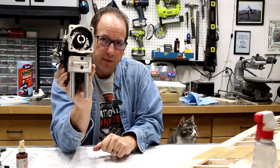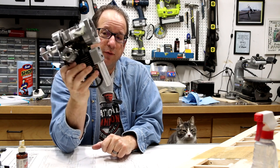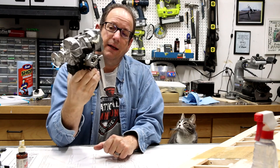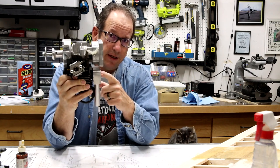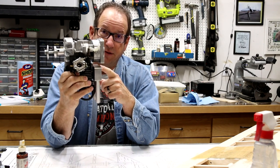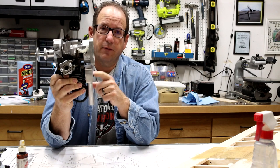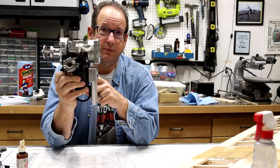This is a muffler that came from a company that marketed this as being specifically to fit this engine block. And it came with specifically sized bolts to hold everything in. And I specifically put them in there. But the threads were not the same size as the threads that were in the engine block. So I ended up stripping the ones that were in the engine block.